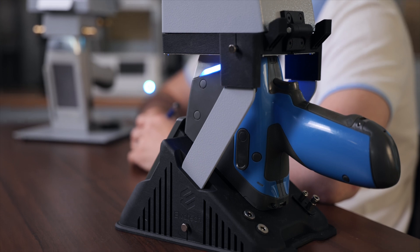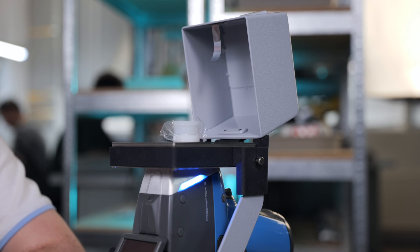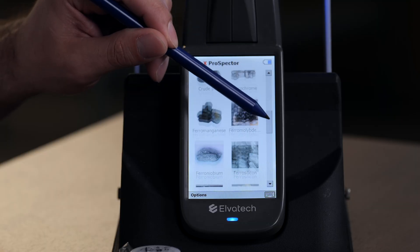Let's move on to analyzing our samples. We have several samples of ferro-alloys to ensure comprehensive testing. Here we have our laboratory stands and the Prospector 3 handheld XRF analyzer. All these components are essential for precise and efficient analysis. The laboratory stand provides stable positioning, which is especially important for consistent results. We will demonstrate how to analyze ferro-alloys using the Prospector 3 on our laboratory stand. This combination provides both mobility and stability, allowing for precise measurement in various settings. The Prospector 3 comes equipped with special calibration specifically designed for ferro-alloys, ensuring optimal accuracy for this application.